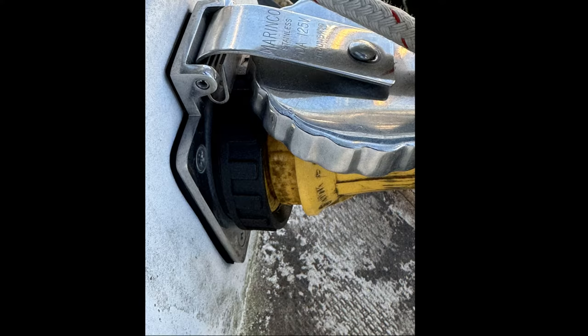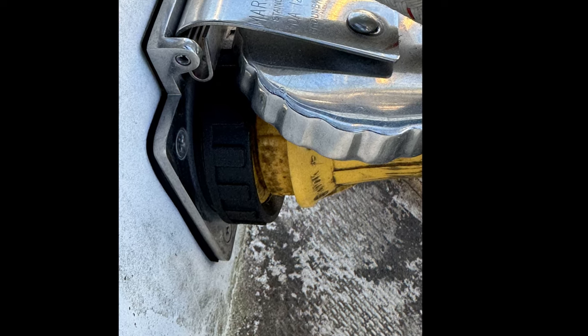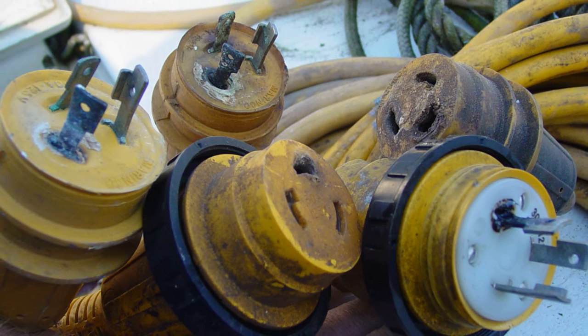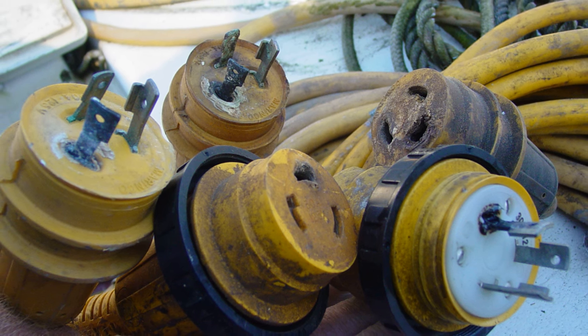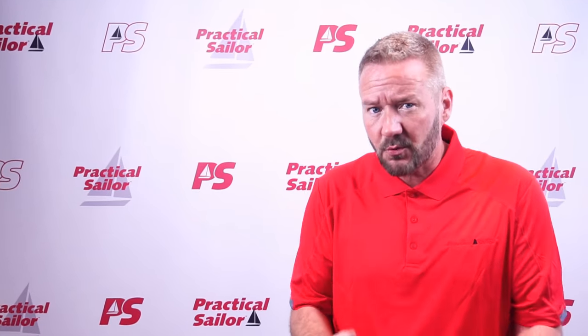The last thing that sort of slapped me in the face — I feel like Frank might have been calling me out here. Your shore power cable can carry a lot of load, especially when you're running the AC. That little retaining ring that I sometimes don't thread down — it's there for a reason, and not just so it doesn't fall out if someone kicks the cord. It's there to make sure you get a secure connection. The metal prongs need to make extremely solid contact; any gap or loose fitment causes restriction, which causes heat, which causes fire. So why do I always forget to thread down the retaining ring? Probably because I'm lazy — and that's dangerous. What's on your checklist for your pre-launch? Leave it in the comments and let's help each other have a safe and fun boating season.